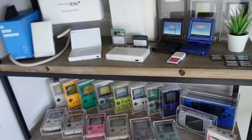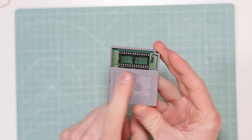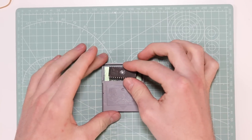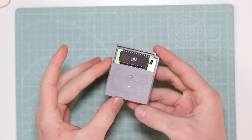I wonder what game is on there — leave a comment down below which one you think it could be. Okay, so we're going to start off by giving the cartridge itself a bit of a clean, because there's a bunch of sticky residue on here and these things are obviously very old. I want to give the contacts a clean and show you the inside. Once the EEPROM is plugged in, it looks a lot more familiar to a development or prototype Game Boy cartridge, but obviously we need to get the game on here.